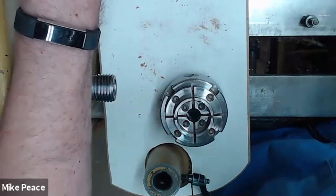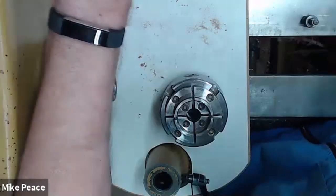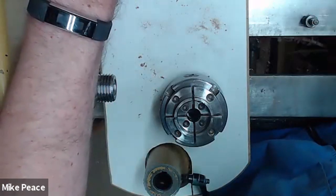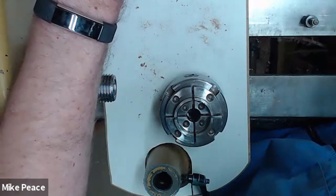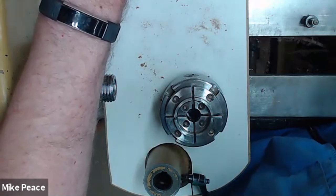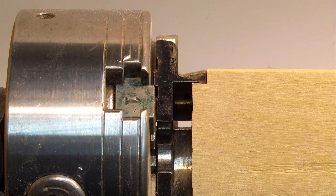This is the Nova or Record Power or Robert Sorby micro dovetail that grabs a tenon. You make a parallel wall and that tiny little hawk tooth, so to speak, bites into the wood. They say, don't turn a groove there or you lose the strength. I haven't gotten to the washer yet, but that's the parallel tenon where it's biting in that tiny micro dovetail. Now let me see if I can find that washer.